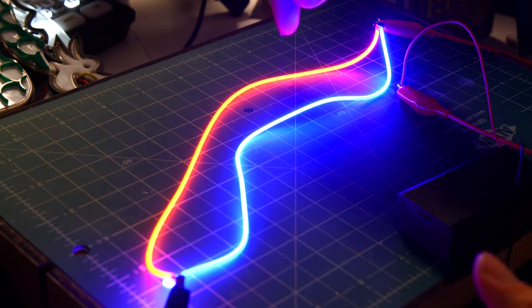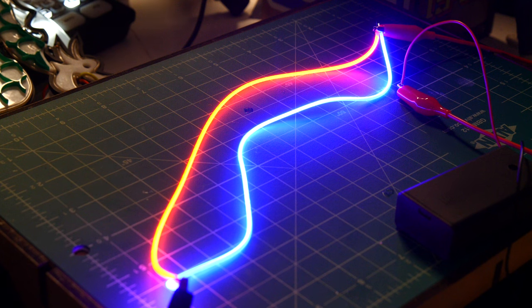You are limited running in parallel in terms of arrangements. For my project, I want to light them in series — one end to the next to make a longer strand of LED filament wire. For that you're going to need higher voltage; two AA batteries won't cut it. Two strands in series needs 6 volts, three strands 9 volts. Conveniently, a 9-volt battery gives you about three feet of light. But my project is going to call for maybe eight of these — up to 24 volts needed to run them all in series.